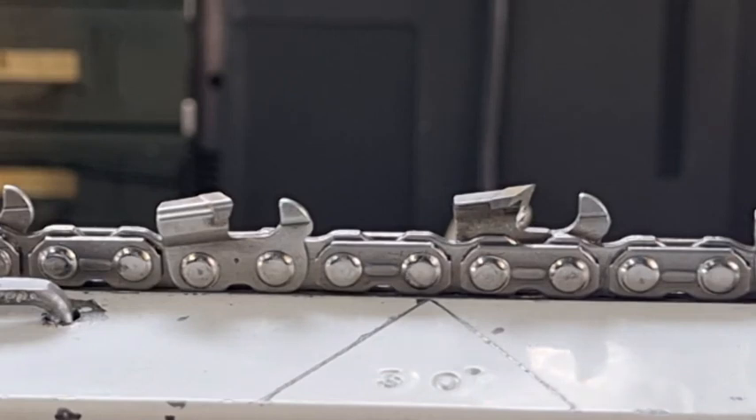I've only got good things to say about tungsten carbide chains. They've got a purpose — I certainly wouldn't go out and buy one as my everyday firewood chain because they cut 30% slower, so there's no point in that. Their application is generally for dirty applications where wood's been laying around in a paddock for a long time and a normal chain would get blunt immediately because of all the dirt and rubbish. Thanks for watching, give us a thumbs up — all comments are welcome, bye for now.